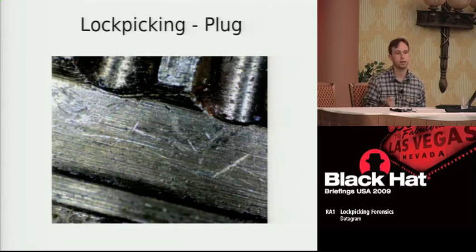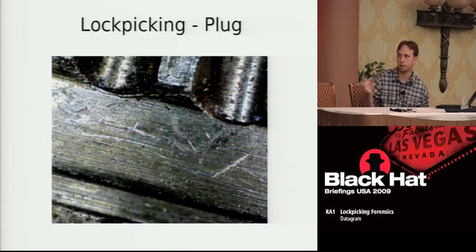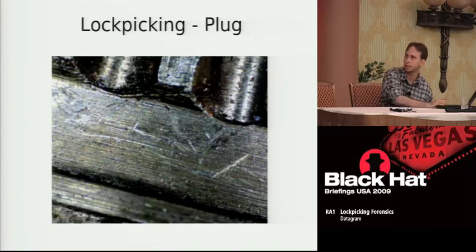The walls of the plug, another excellent source. Obviously, your key's touching the sides of the plug, those walls. Would a key make these strange angles, these strange number of marks? Definitely not. If it does make marks, which is possible, because keys are sometimes cut wrong, or the plug may be just too tight for the key or something, there'll be a very uniform type of mark. Not like this, where the angles, as well as the length, the depth, everything is very randomized.